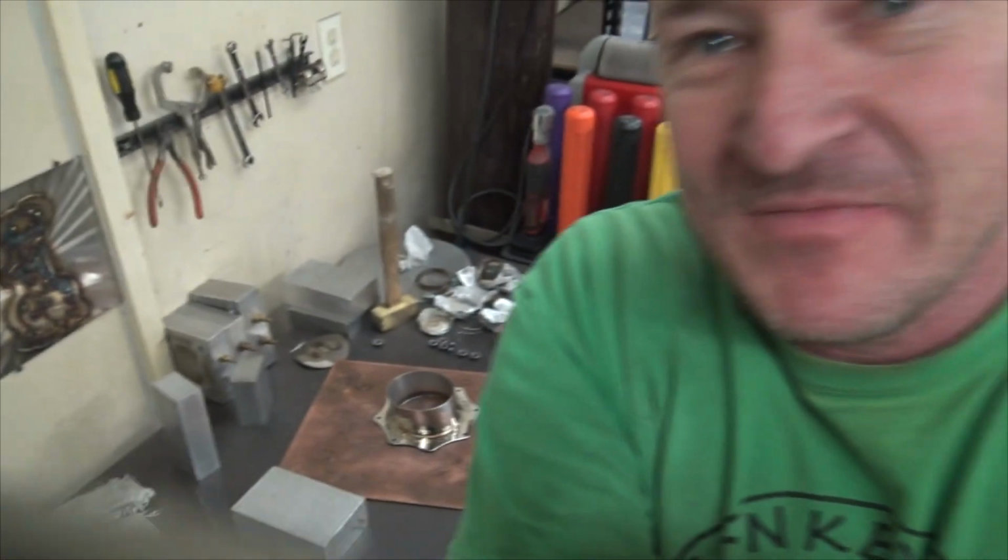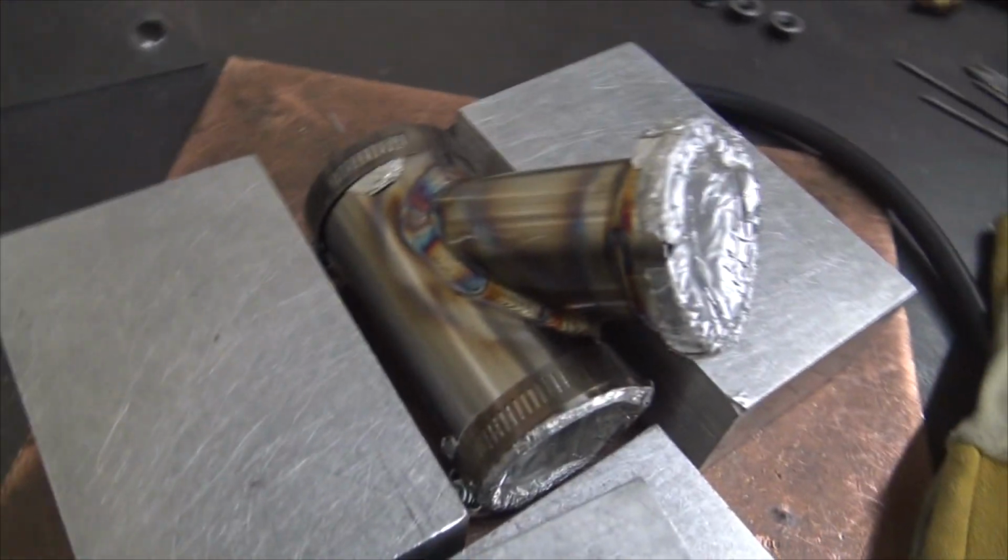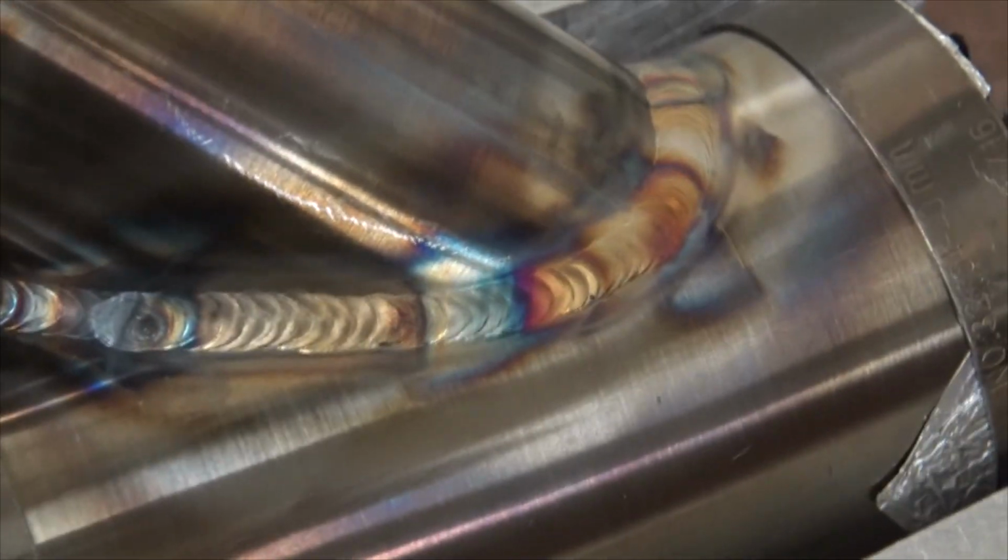So great machine. We'll do an aluminum test because I know everybody's going to want to know, how's it do aluminum? Probably better than me. Truth be known, better than I can. So yeah, we'll do aluminum and then we'll get this thing raffled off, help some people out. Showing you guys a little bit more of how this thing does with the stainless. And I like it. It's really nice. This is with my number 16 cup and flowing like 30 CFH. This was with my top secret squirrel pulse setting that I told you guys about. Please don't share it with anybody.